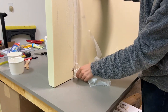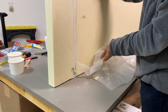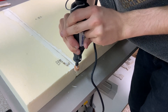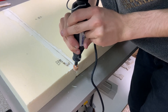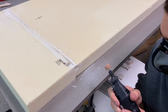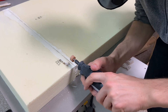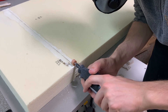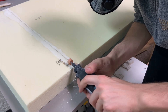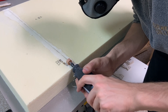I learned the hard way that you should definitely use wax paper — other materials do not work quite as well. With the wax paper removed, it's quite easy to see the very strong joint that is now formed between the two foam blocks. From here, I used a Dremel tool to file down those micro balloons and epoxy to get the correct shape. I highly recommend using a vacuum cleaner to pick up the dust because it is not pleasant when it gets in your eyes. Safety glasses don't really work well, so a vacuum to suck up that dust, keeping it very close to the Dremel as it goes, is definitely advisable. Moral of the story: protective equipment is important. Those micro balloons are not fun to breathe either, so a mask and safety glasses are probably best, even though they're annoying.